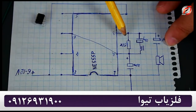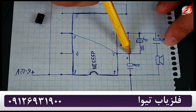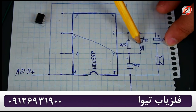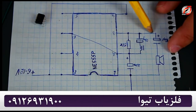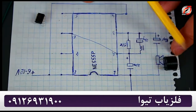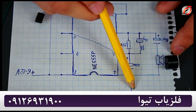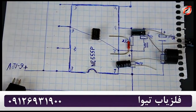Then we'll need to fit a 51kΩ resistor between the second and the third leads, and a 2.2uF capacitor between the first and the second leads. There will be one contact that will connect the capacitor and the resistor with the coil, which we'll make later on. We will connect the second wire of the coil to the first 2.2uF capacitor, then connect that capacitor to the second 10uF capacitor. Here is where we will fit the speaker — the speaker's contact will be connected to the first lead, and the other lead will be the minus. So let's start soldering all of the components to the circuit board.